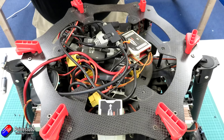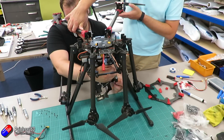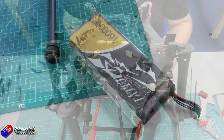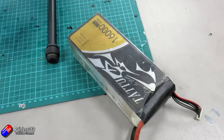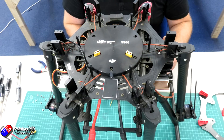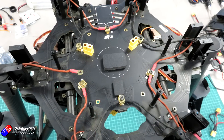With the top off and all the electronics pulled, you can see the power distribution board in the middle with two XT60 connectors and two big power connectors at the front that connect to that house brick sized 6S battery. Under that cover are all the connections that go out to the ESCs and motors. The wire gauge isn't huge because they're low KV motors with very big props and don't pull ridiculous amounts of current.